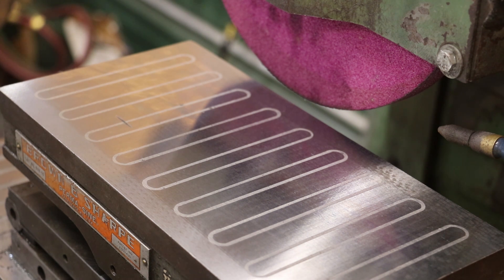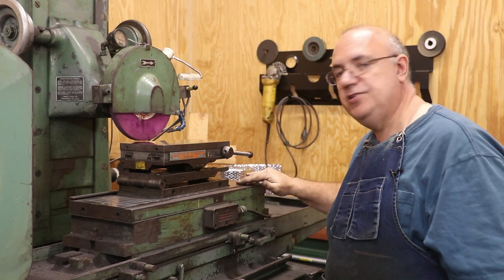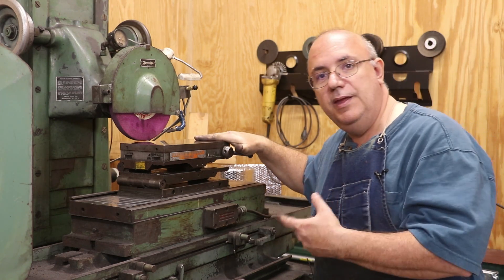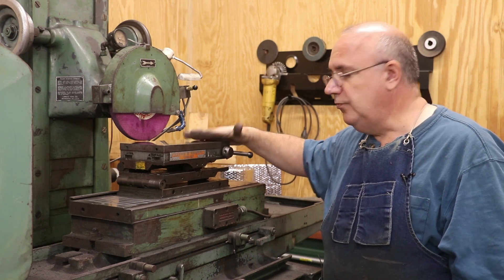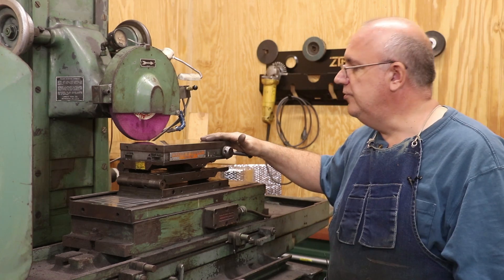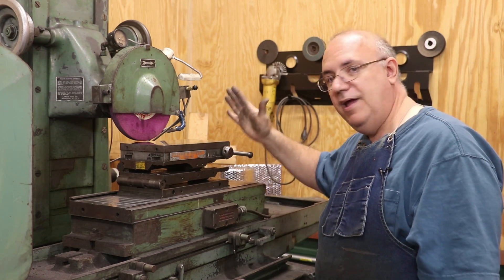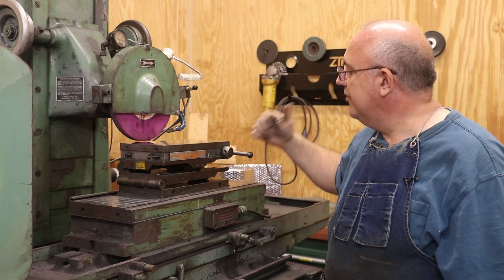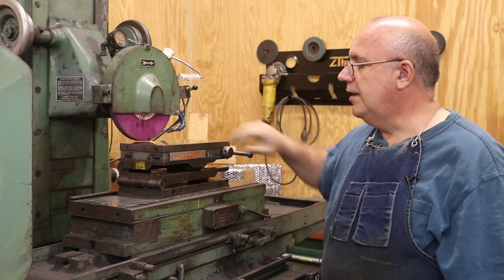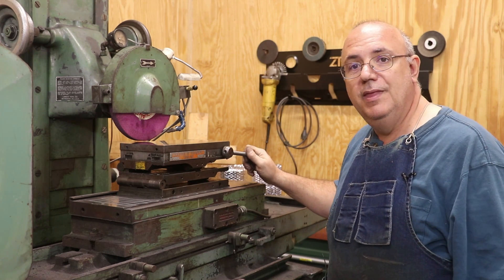I've got a job we're going to be doing on this — cutting a single angle, not a compound angle — and we'll be doing that in another video down the road. There you go guys, a quick little video on regrinding a magnetic chuck. This is something you just need to do on your surface grinders from time to time — just freshen these surfaces up, make sure they're good and true. With this being a brand new one to me, I just wanted to verify I had confidence that it was flat. The only thing I'd do different is make sure I had that magnetic field on the entire time. But we cleaned that up on that last pass. Ideally you'd want to do this with the magnetic field turned on the whole time. Thank you guys for watching — leave me some comments, thumbs up if you like what you see, please subscribe to the channel, and we'll catch you next time.